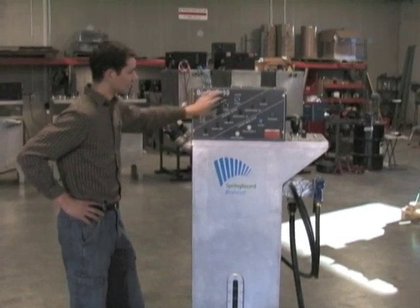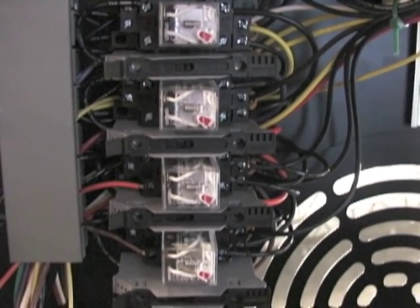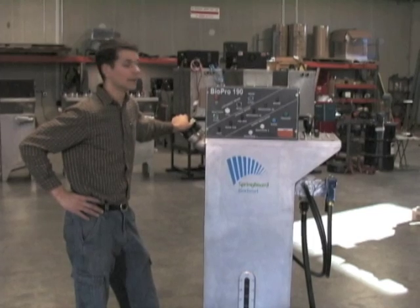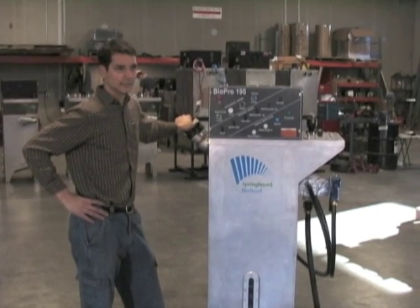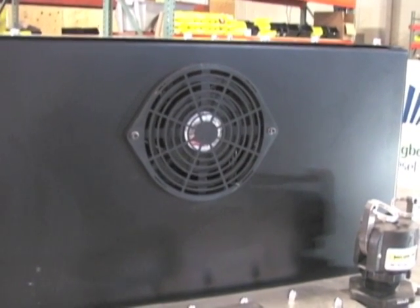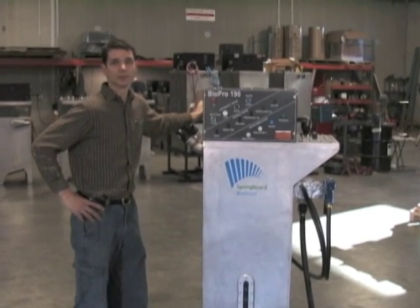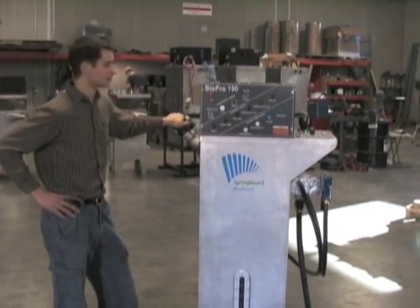The electronics in the machine also contribute to safety. The relays are ice cube-style relays that allow the contacts within the relay and the coil to be completely enclosed in a plastic housing and prevent the risk of a spark igniting any methanol vapors. Add to all that the redundant safety feature of a 250 cubic feet per minute fan that purges this enclosure, so just in case any methanol fumes do get in, they're immediately purged and don't build up within the component housing of this machine.